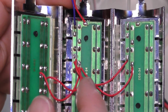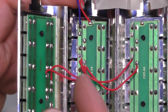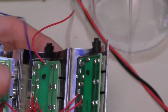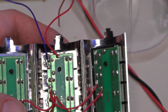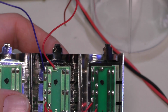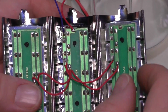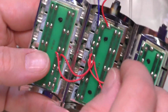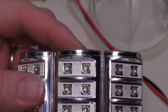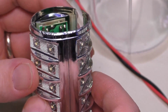in. It is confusing that they use the same color red wire here. And by the way, this is really an anemic kind of wire. I hooked this up to my power supply here using these alligator leads, and I initially had it set to run one LED at 3 volts, 20 milliamps, and it turned on, but it was very dim, and I ramped it up until the current limiting just switched off, and it was at 200 milliamps, just shy of that for the whole panel. And they were running a little bit warm, and that's white, but red's going to be at a lower voltage, so we'll have to see exactly what the maximum draw is going to be and perhaps calculate runtime.